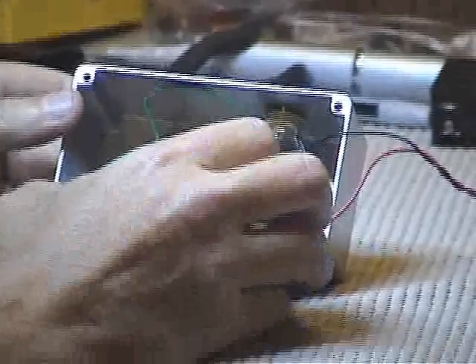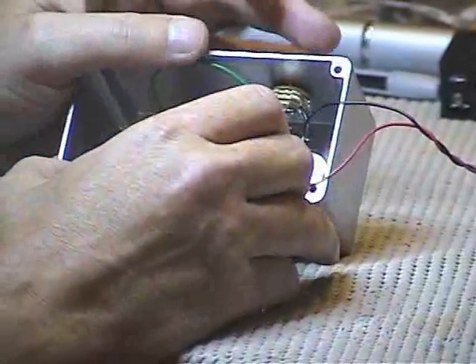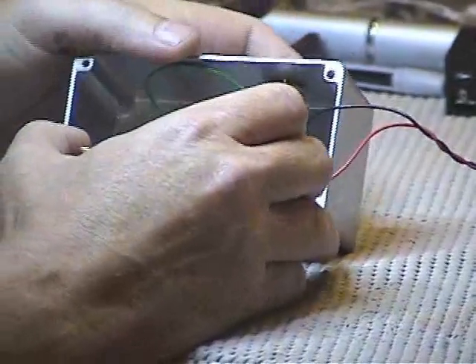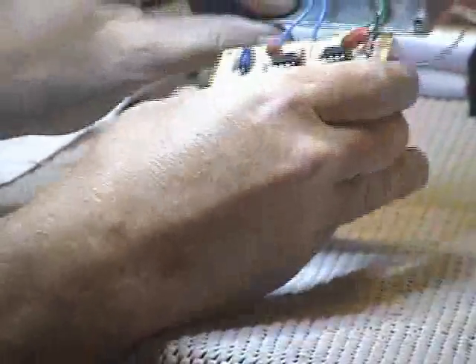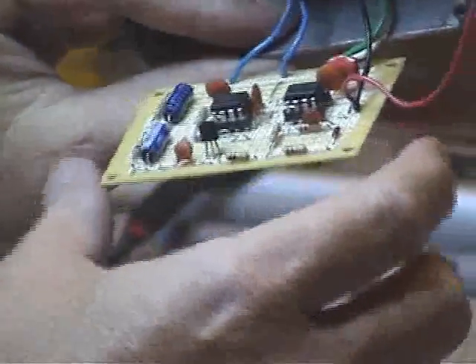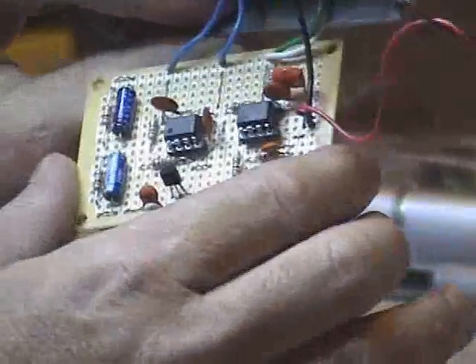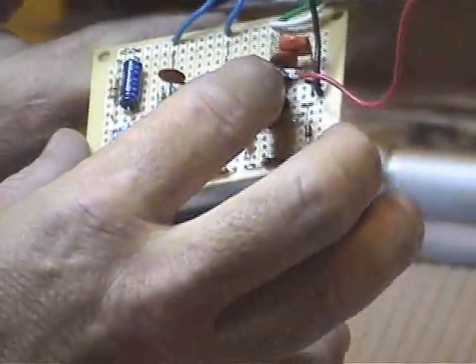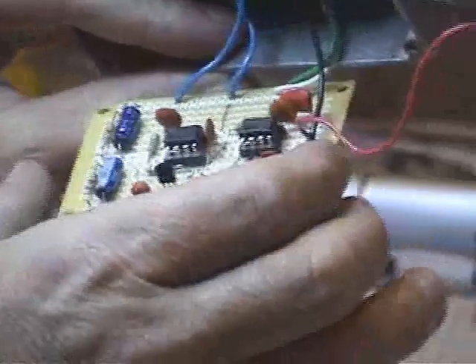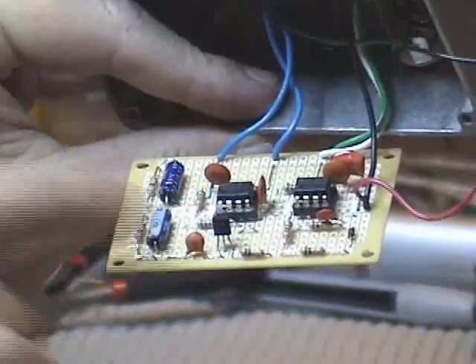You've got the normal gut stuff here. Your standard blue bypass switch, TRS jack in the input, TS jack in the output. The one and only pot, as per design specifications. There are only two chips — one is the timer, and this is the one that's making all the squealy noise — we're going to make it stop doing that. And this is the dual op amp. It is in between the dual op amp that this FET is connected, and the signal goes through the FET.